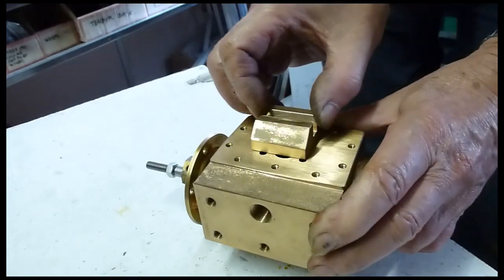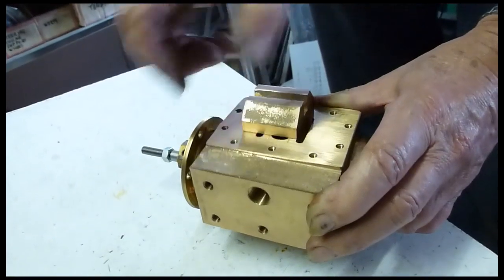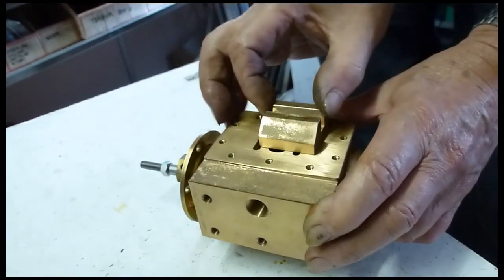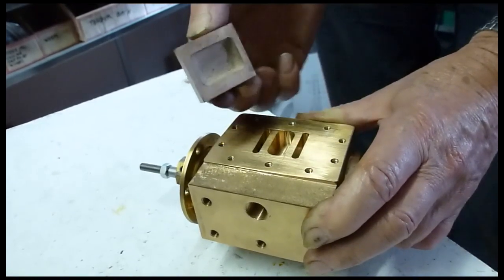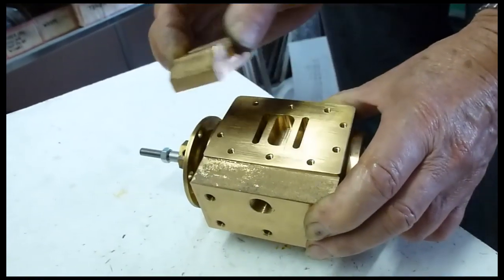Effectively it's going to and fro like that, connecting first this one to live steam and that one to exhaust, and then this one to live steam and that one to exhaust. Of course this is all happening very fast, but if you understand the principles of it, you know what you're trying to aim for when you set the valve.